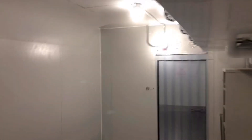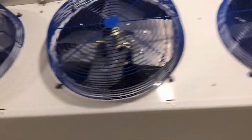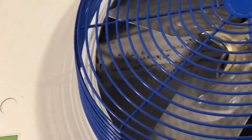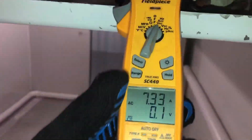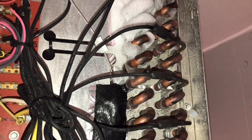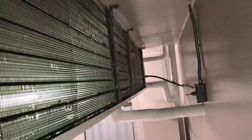For right now he wants me to go ahead and monitor this defrost and see if we're steaming up too much. As you can see inside there, the top part of the coil still has a bit of an ice buildup — right in there too, and that one too. He wants that taken care of today. I just checked amp draw across every single one of these heaters, and all the heaters are running properly. So now we can go ahead and monitor it and see if it's going to steam up. You can see way at the end, you've got some ice right there. We're just going to see if it starts steaming before it terminates.